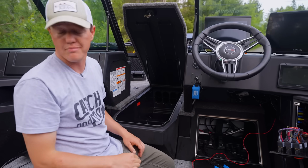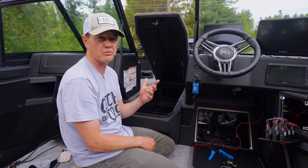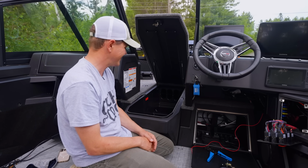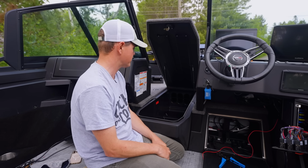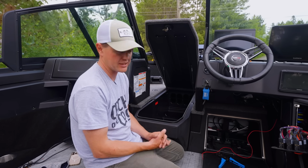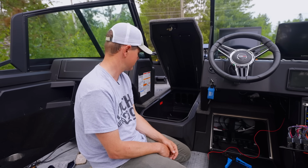All right, we're gonna start laying some batteries. I'm gonna go in 36 at the front, and then another 36, and then a 16. I stumbled upon Russell Marine Products. They sell a lot of online stuff and rig a lot of boats. And they recommended 10 gauge, this marine wire. Basically, it comes in this single white cord, and you splice it apart. But that's what I did for this boat. I think I bought 100 feet, and it was enough to rig. I pretty much used every single foot of it. Other than that, we're gonna drop the batteries in and start hooking things up.